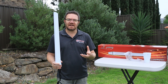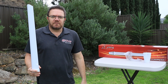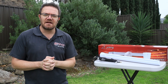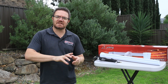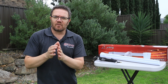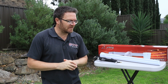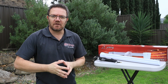With one antenna like the Omni 414 it's nice and compact — simple, gives you four-by-four into the modem. But keeping it real: if you have the budget and are willing to put in the extra effort, get two Omni 402s and space them apart. Both options are available on our website. Physics will always dictate what we can do — the Omni 414 gives you simplicity with one antenna and four cables, while the Omni 402s give you spatial separation and more variables to play with.